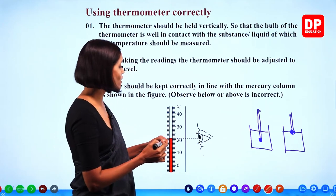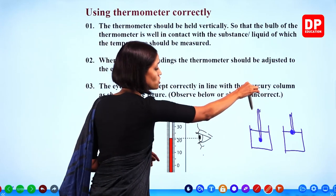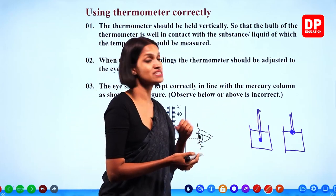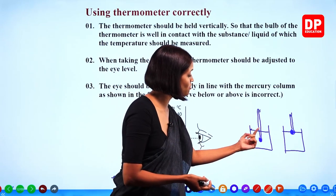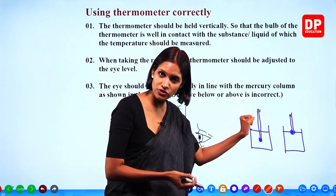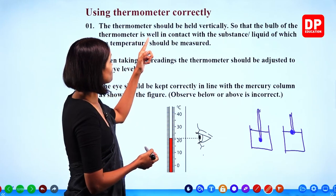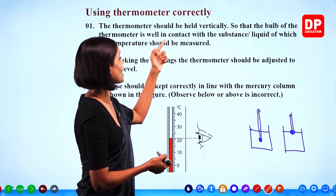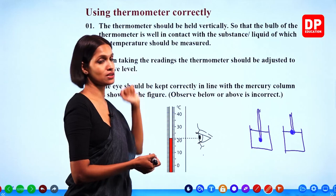And the other thing is, you have to make sure that when you immerse this thermometer, it should not touch the walls or the bottom of the vessel that the substance is contained in, right? In that way, the bulb cannot feel the correct temperature of the substance that you are going to take the temperature of, right, children? So the thermometer should be held vertically so that the bulb of the thermometer is well in contact with the substance or liquid of which the temperature should be measured. Okay,